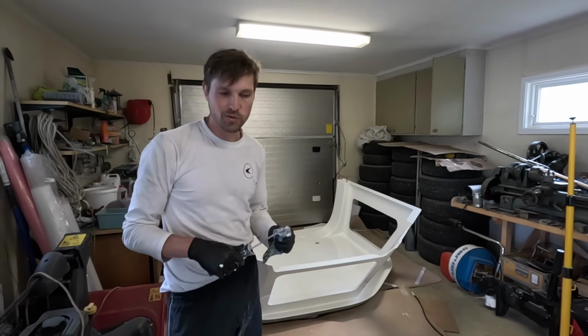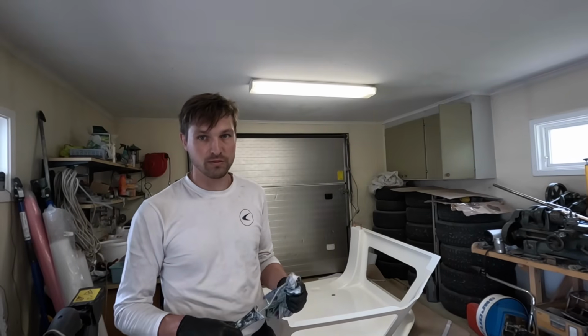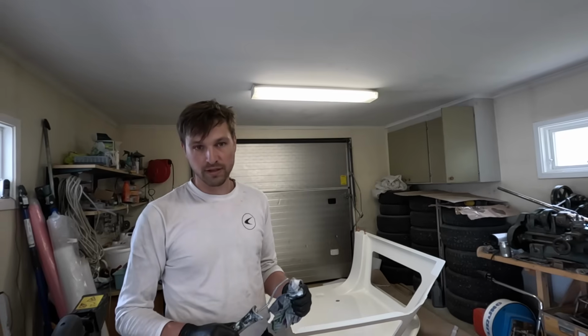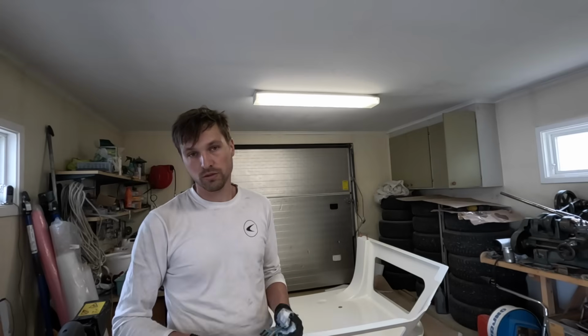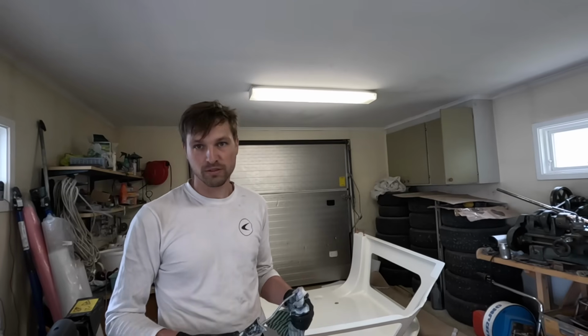Then we're also gonna glue on a sheet of aluminum. So we'll have this sheet of aluminum metal, 1 millimeter thick, that we're gonna glue onto the top of the doghouse, and then we'll glue the panels on top of them. And the idea of that one is not to dissipate the heat, but to distribute the heat, so that any potential hotspots due to shading, for example, will hopefully not damage the panels.